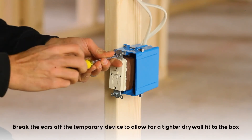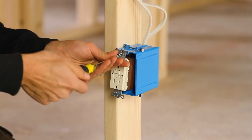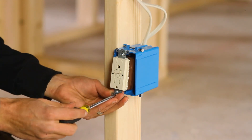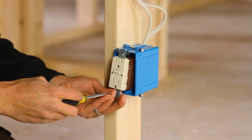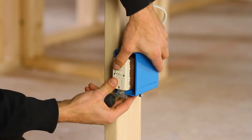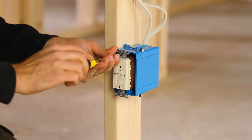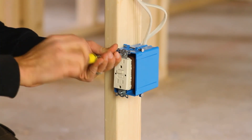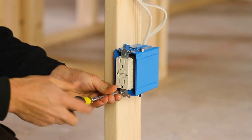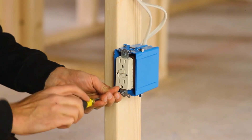I'm using my number one square drive — an insulated handle, 9-inch long square drive. It's my preferred implement for all electrical devices, residential and commercial. I'm gonna seat the top screw, then seat the bottom screw, and then depress the device fully to make sure it's a good fit without feeling the pressure of conductors behind the GFCI. I'll snug it all the way down. This is a plastic threaded box — it's not meant for the death grip. I'm just gonna snug it down.